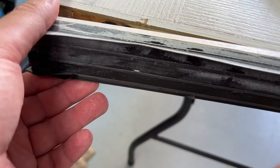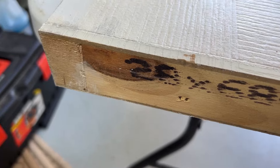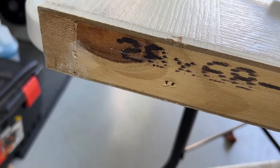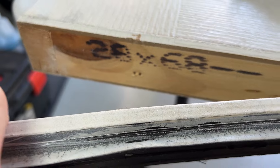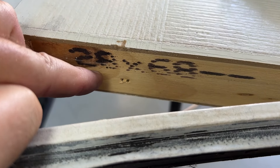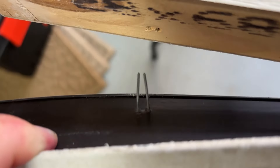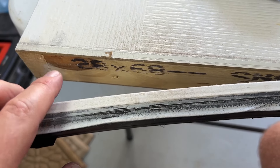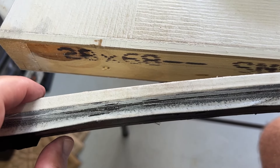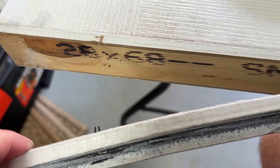In this case, these staples are OEM. We have no channels in the wood — those are the original fasteners to keep this on the door. But yours may have channels cut going across the door with little pieces of rubber that just press in. They're very hard to get back into a door if you put a new strip on, so that's why I went with a universal kit, which I'll show you in a second.